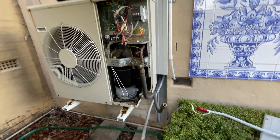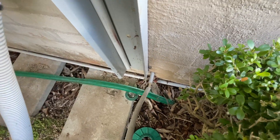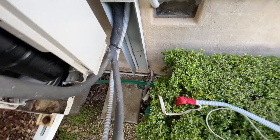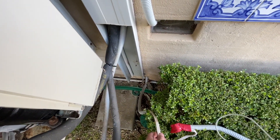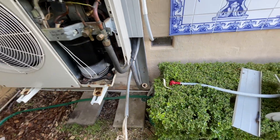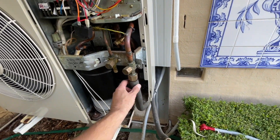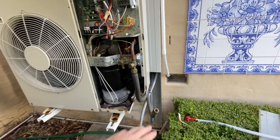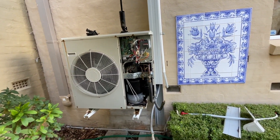Alright, it's done. I've disconnected the electrical — that's broken, obviously — and plus it's got a joint in it, pretty dicey. I'm going to sort all that out, probably just cut it there, put some rigid conduit in and put an isolator down there. Honestly, Andre the Giant himself must have done that up — can't loosen that fitting at all. I'll just cut it, put it all back together, get it on the trolley and take it back to the van.